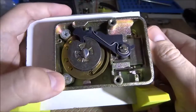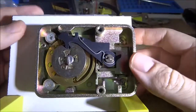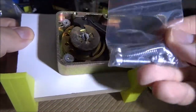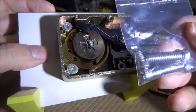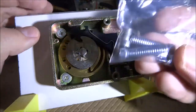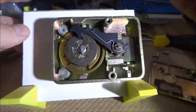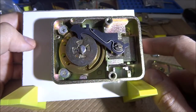There are four screws holding the lock part in place — two here and two inside. The screws that come in the kit are not ideal for putting into wood, so I had to find my own screws. Those kit screws are probably fine for an actual safe where there's a prepared hole for the lock, but if not, you'll need your own wood screws.